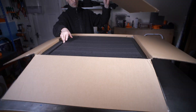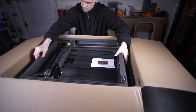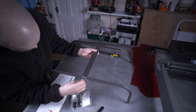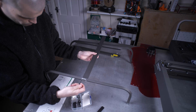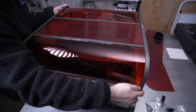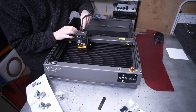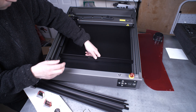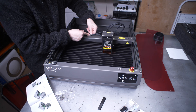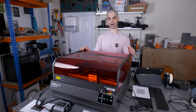Let's go over the unboxing and setup. It's well packaged and comes partially assembled. All you need to do is install the top hat enclosure section — bolting together some aluminium frame, feeding in the flexible plastic covering, and fitting the hard rigid plastic covering on the sides. After that it's connecting the air assist, installing the laser module, installing the bottom drawer and slatted bed, and doing a little cable management and plugging in the fan. This took me approximately 30 minutes to get up and running.